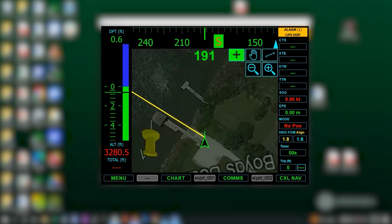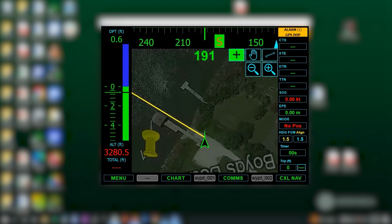So when do we want to do a compass calibration? Well, you want to do a compass calibration whenever you change the environment, you're going a long distance that you haven't been in before, or different areas of operation. Whenever you're introducing new equipment to the DPD profile, whenever you change batteries, whenever you change your buddy, and so forth.